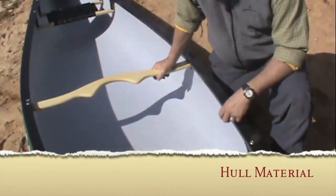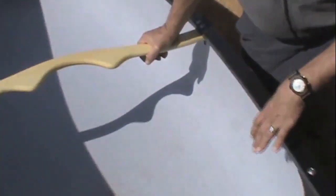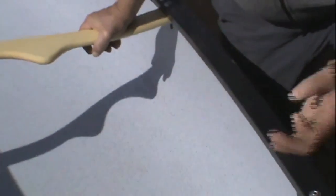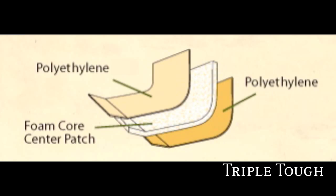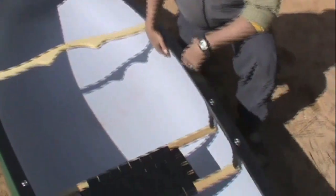The boats are manufactured in what we call triple tough polyethylene — the same kind used in making whitewater kayaks. What makes it unique for a canoe is that it has an outer skin, a center foam core, and an internal skin. The foam core gives the hull stiffness so that when you put it in the water it will not invert, or what they call oil can. It also provides flotation — there are no flotation chambers in the ends of this boat because the foam in the core material of the hull provides all the flotation necessary to keep the boat afloat.